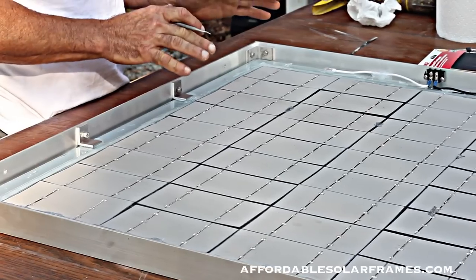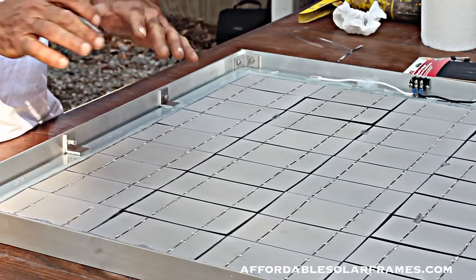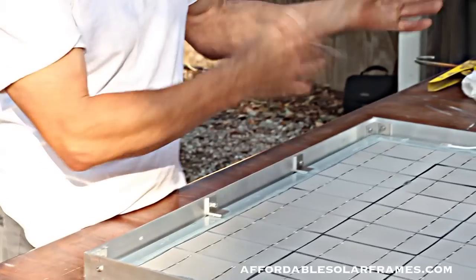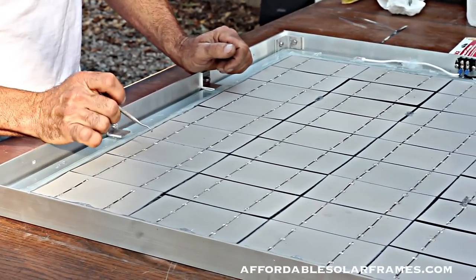What I'm looking for is one that's oddball. This one's reading three, three, three, and then you've got one that's one amp - you know there's a problem. Go ahead and take it out, ditch it, and put in another one. I did find one bad in this one and I had to replace it.